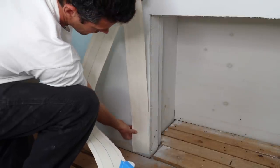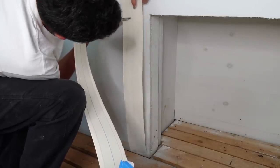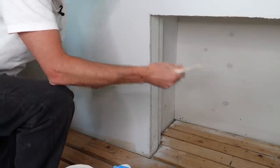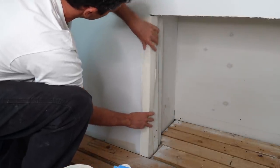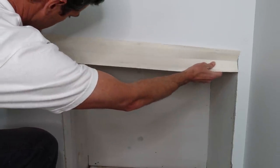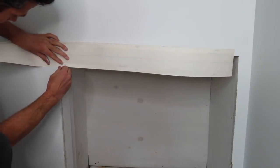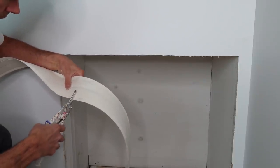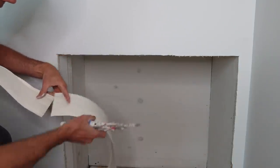Pull enough out of the box to get it right down to the bottom — I'm just going to eyeball this, leave it a tiny bit short so I don't have to cut it again. Pre-crease it. This one needs to go end to end, very close — within an eighth of an inch or less. This will be the first one we install and the other two will butt up to this one.